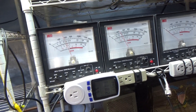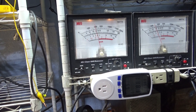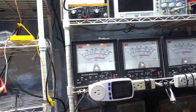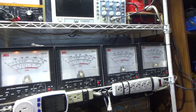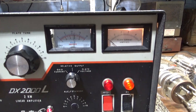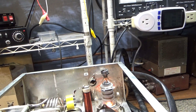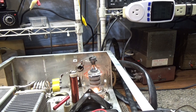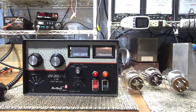About 300 watts on the Bird meter and about 35 or so watts going into it, so it's doing about eight times what's going into it. I don't have the highest plate voltage running on this thing, and it doesn't have a tuned input, so not all of that drive is making it into the tubes. But the tubes seem to be doing what they're supposed to do.